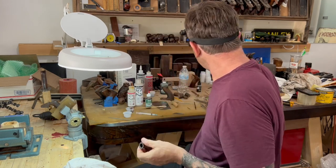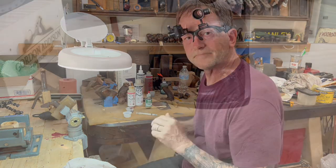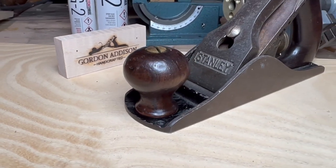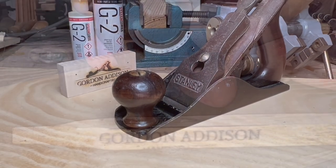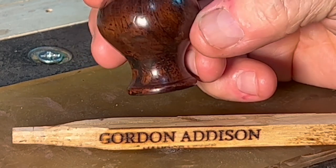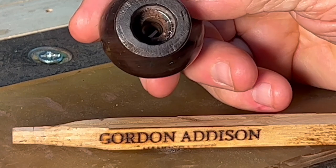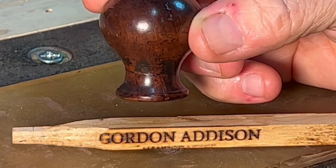After that I'll put it on a stick and spray it and see what it looks like. Our finished product here is three coats of lacquer with 4/0 steel wool in between, and a final coat of paste wax on top. Original patina, the original bead is still there, and the product itself is stable. We've addressed those fractures along the bottom, put a coating of epoxy on the inside as well, which will help secure it and keep it all in one piece. I like the way this one turned out — I hope you did too. Thanks for watching, subscribe, stick around. See you guys next time.